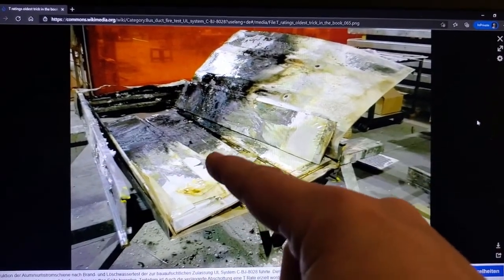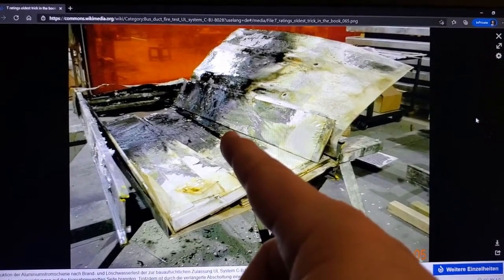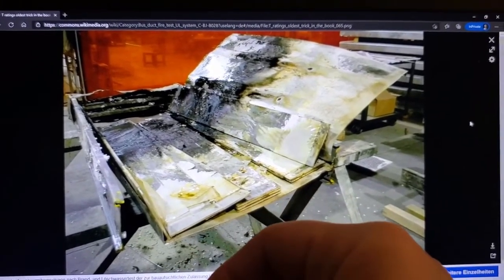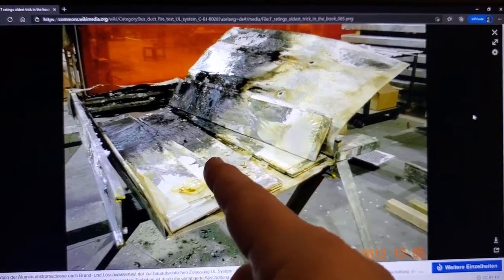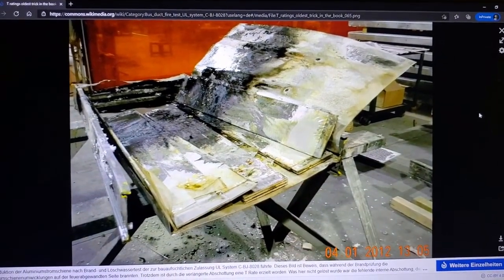Look at the T rating, which tells you the thermal information that's being offered for testing of pressurization ductwork in ASTM E2816 and ISO 6944. They're getting you both the hose stream and the thermal data by beating up on the fire stop instead of the engulfment sample.